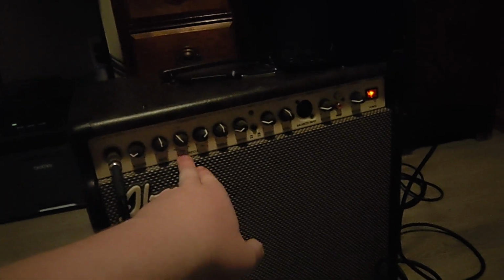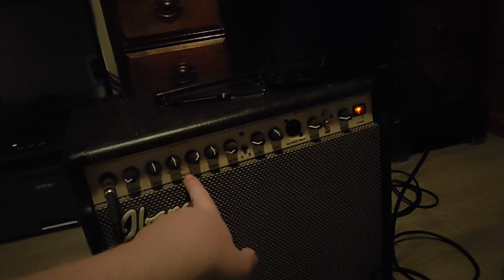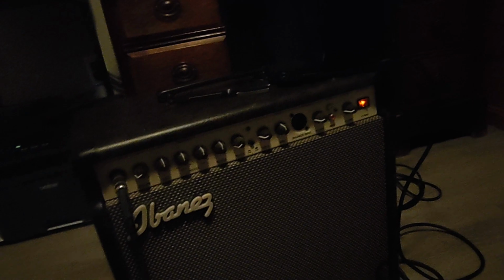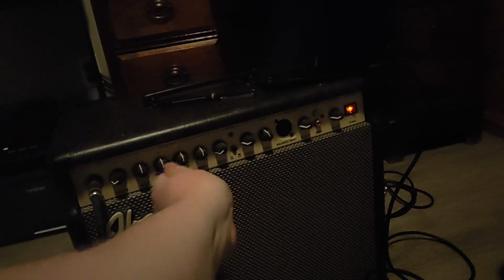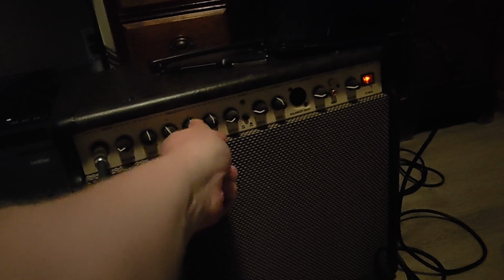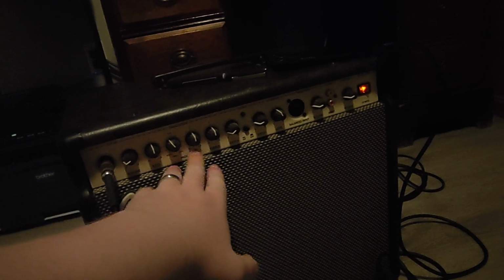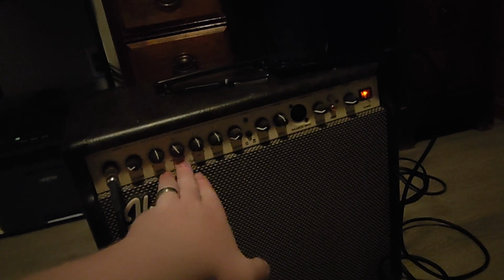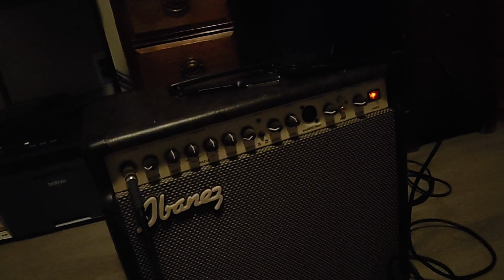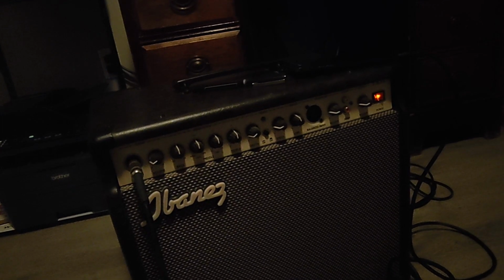Your middle frequency and middle level. Now this is frequency selected, so whatever I set this to, if I set it to 1 kilohertz, then I should be able to amplify or decrease the amount of gain of that 1 kHz signal. This one is selectable between 400 hertz to 2000 hertz. So depending on what frequency I have this tuned to, that is the frequency that's going to receive the amplification. So we've got two things that we can test with this. We can test that the amplifier circuitry is working correctly. We can also test that when this knob is tuned, whatever tunable filtering circuitry, if I can put it that way, is actually tuning to what's on the dial.